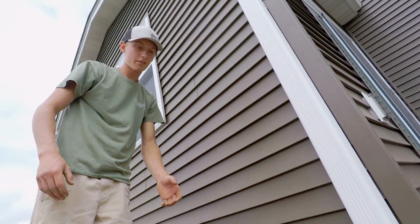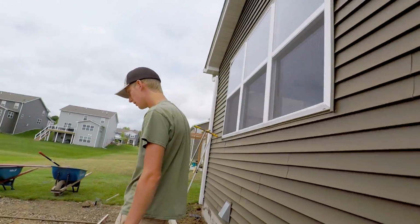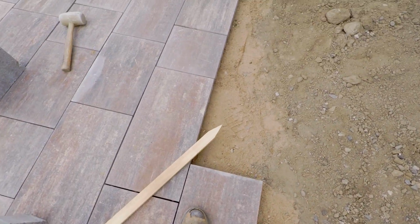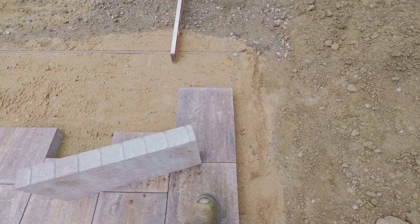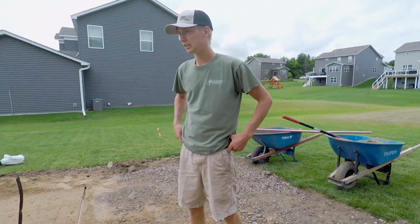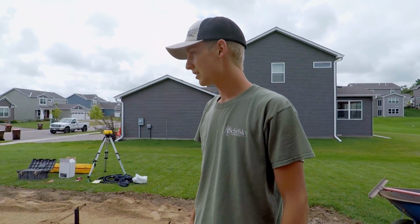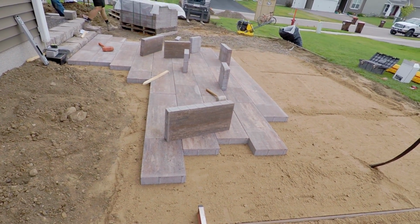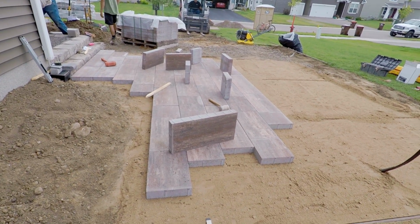Sit like that. We're gonna have our soldiers come in along here. Colton's getting us another pallet of material. It's moving along very well. It's pretty straightforward. We're just doing a running bond, random pattern, no particular order. Just got to make sure the seams don't line up.